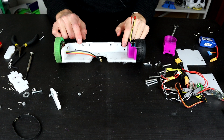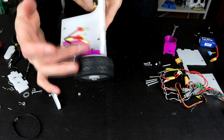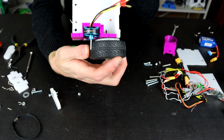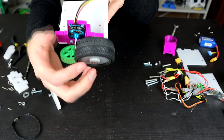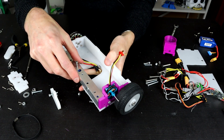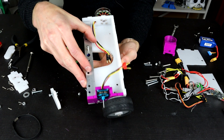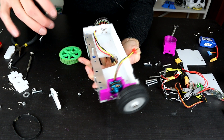That's looking pretty good. I think I've got my tolerances a little bit wrong on this side because the wheel is actually tilted back just a little bit. I also need to change the positioning of this plate so that the wires come out the side rather than out the top. The wheel is just a little bit bent back - it works and the system tangentially drives, but there's probably just a touch too much friction, so we might need to move things slightly. The front plate does still go on, which is good - there's just a little bit of tolerance in there.